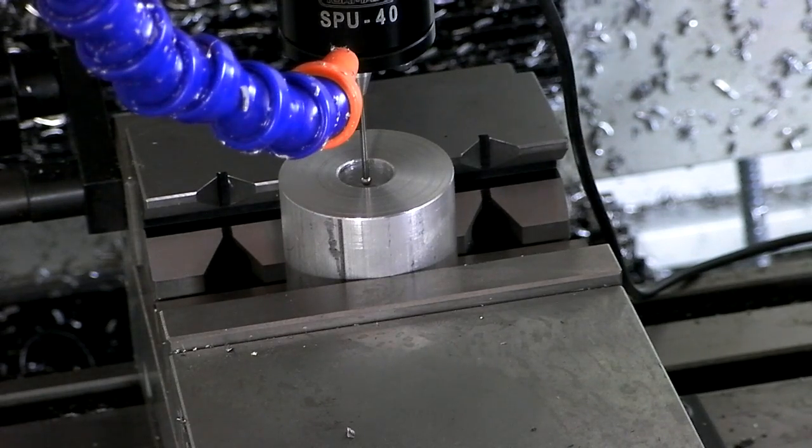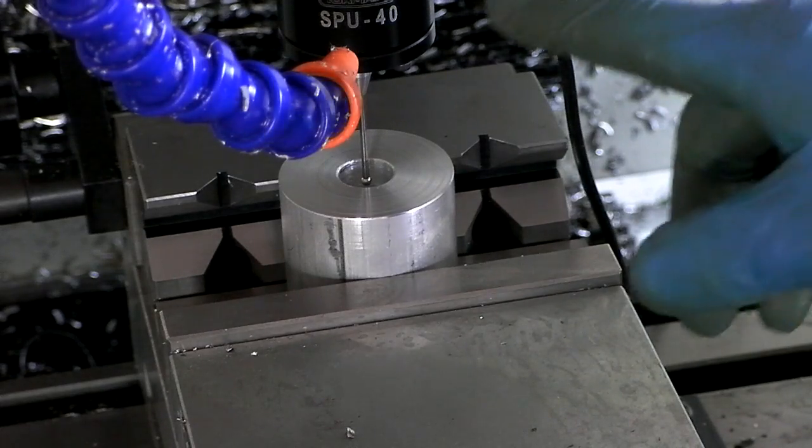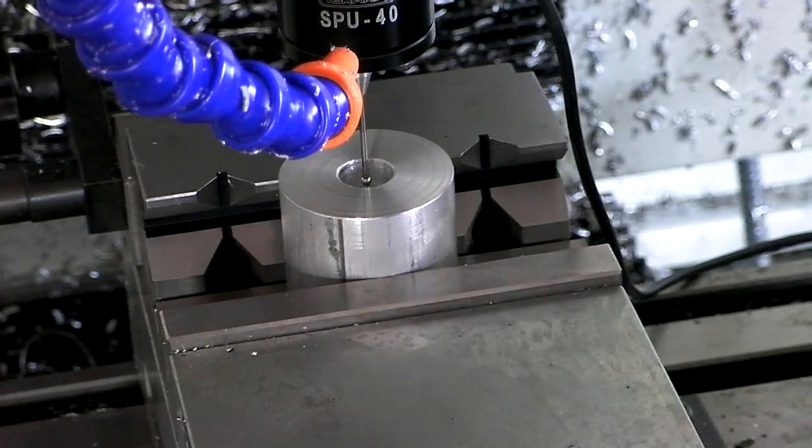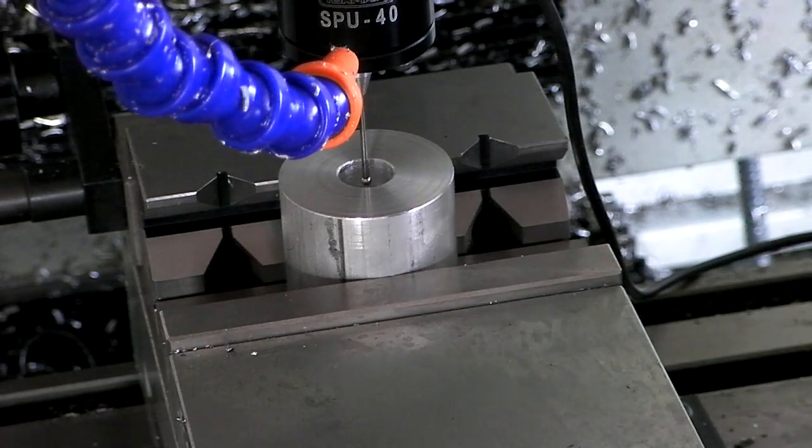For those of you who know anything about work offsets and coordinate systems, all my palettes have their own different coordinate system, and I just created a new one for this one. So this is G58. G54 is kind of the default one, everything uses it, but from now on this vise is going to be G58. That way I can put my palettes back on and everything is the way I need it to be at G54 or whatever they happen to be. Anyway, that's boring.